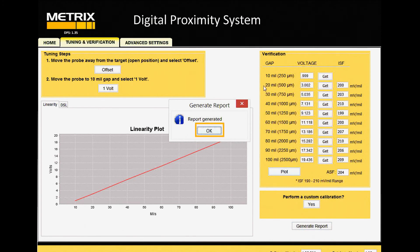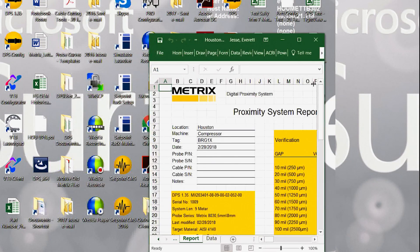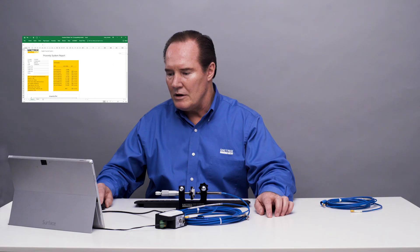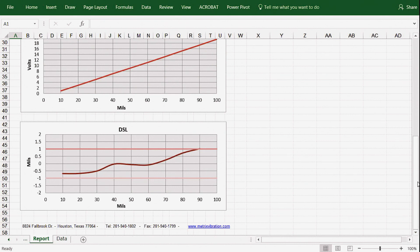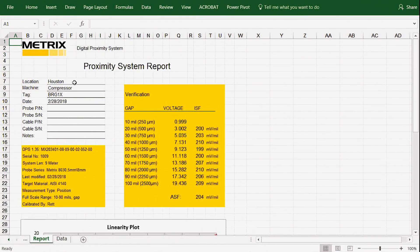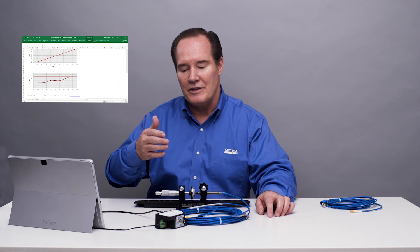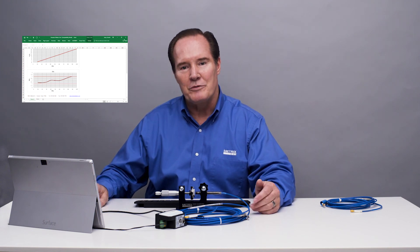I'll save that and say OK. Then I can go to my desktop, find the Houston 9 meter test file, and bring up that data to look at the report. The deviation from straight line is a little bit high here, so maybe a custom cal would have been in order. You can put notes in and still type into this report to amend it — that gives you a lot of flexibility. Also, the logo you can change out and put your own in, add your address information at the bottom. You can also stack these reports — if you did several measurement points on a machine train, you can put all the points into the same report. It makes it pretty convenient when you're taking probe data.